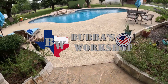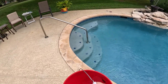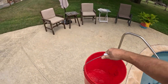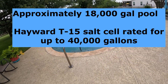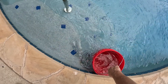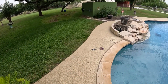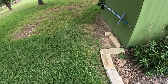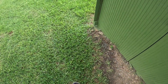I've been checking the chlorine level in my pool and it's just not going up — I keep turning the generator higher and higher. Last year I ran it at about 48% all summer and it stayed perfect. I recently cleaned the salt cell and I don't know what cleaning it would have done, unless I broke a wire, but it just doesn't seem to be working. I checked my phosphates and it's pretty much at zero, so it's not a phosphate issue. It's not a salt issue. So maybe there's something wrong with the generator.